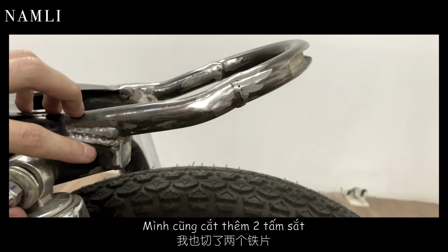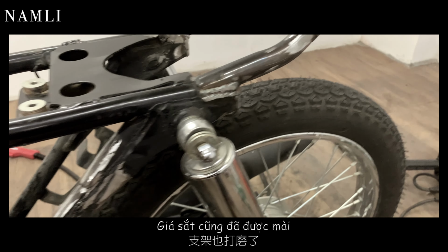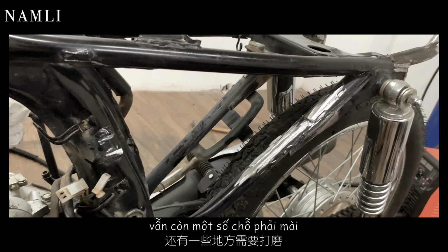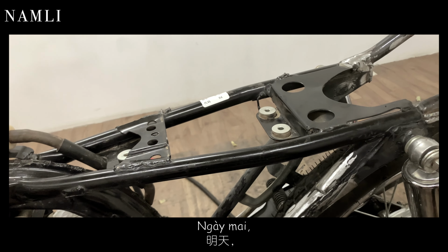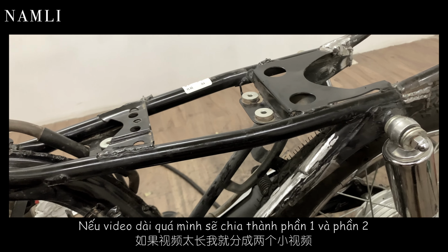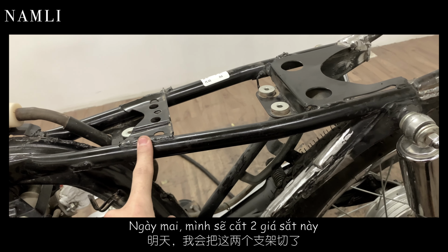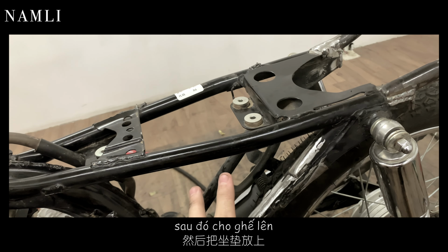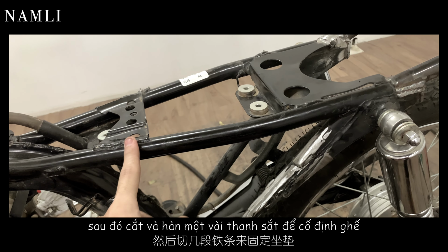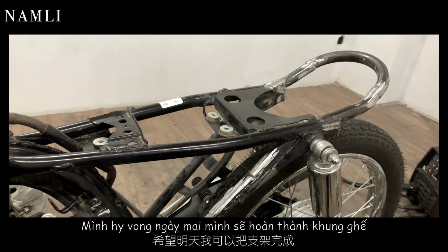And I also cut two pieces of metal and welded them on the back of the frame and cleaned the bracket that we cut before. There are still some left to clean, and tomorrow, maybe in your next video, I don't know, if it is too long, I will put it in part one and part two. So tomorrow I will cut these two brackets and then put on the seat, measure, and cut some flat bar and weld it on to hold the seat. So I hope that tomorrow I can finish this seat frame.